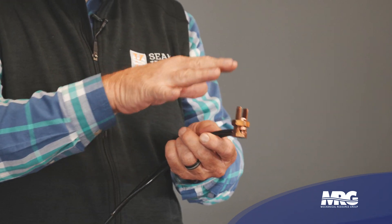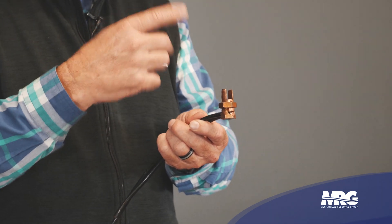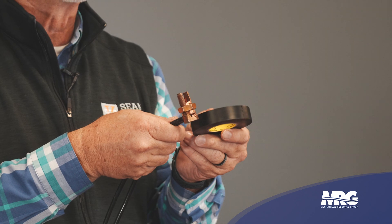This was an acceptable practice for many years. Once the wire is in there, you take rubber tape — it looks like a 33 tape but it's adhesive on one side, rubber and stretchy — and wrap it to make a good ball around the connector. Then wrap with black Super 33 tape on the outside. Now, this doesn't solve the problem of small terminal boxes, but it is an acceptable method of connecting an electric motor.